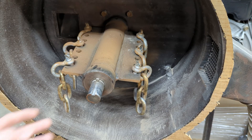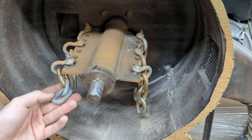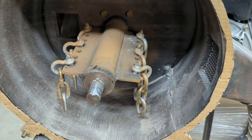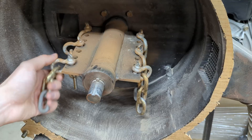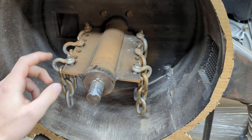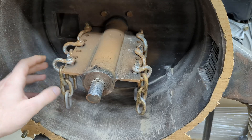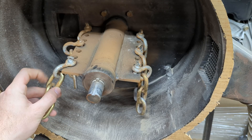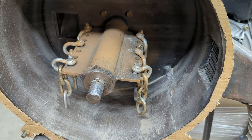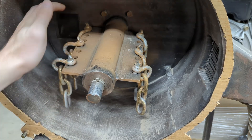The chains I selected are nice, hardened steel chains. As you can tell, I've run this through, and they show wear mainly on one side. Through the amount I've run it, it seems to be holding up quite well. I have the chains connected with these little joints here. I've seen other people use chained ends that unscrew and screw on — that might actually be a better setup for this type of shaft. As you can see, the shaft is super overbuilt and very heavy duty. There are a lot of other holes here, so there's a lot of room for modification.